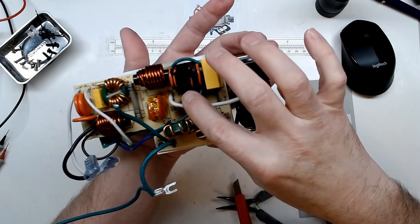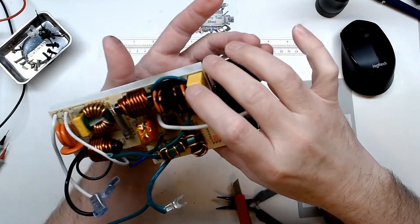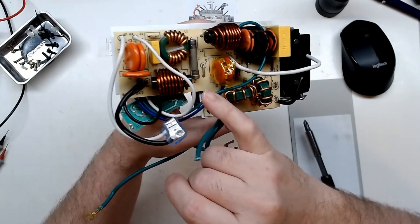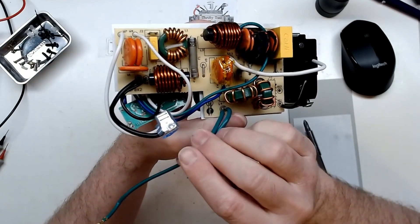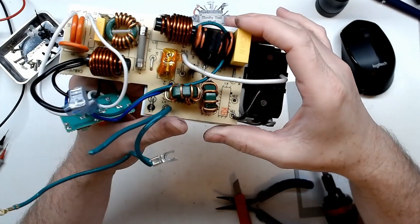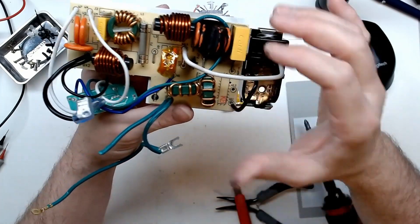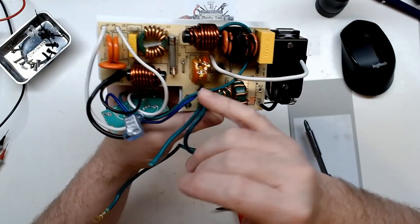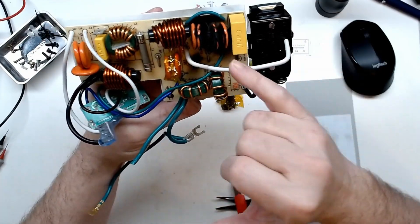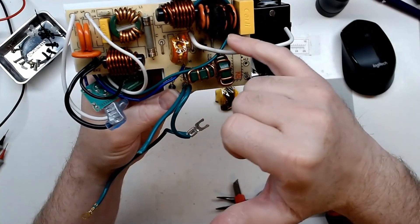We definitely had that MOV smoke, and it may have just been that one disc — maybe one faulty varistor. It is hard to say. As bad as this looks and smells, that's a lot of magic smoke let out. We didn't actually blow the fuse, which was kind of surprising. The ground fault actually protected before the circuit breaker would trip and even before the fuse would blow — very beneficial to have that ground fault on this.